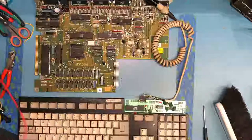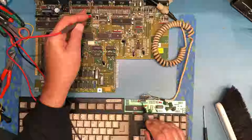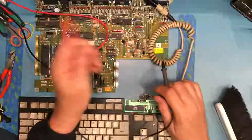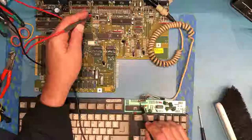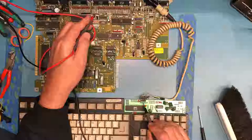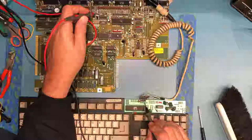But what I am going to do here is basically buzz with everything plugged in. I'm going to buzz the pins out here and see if there's a one-to-one continuity. And so far there is. That would be reset, which doesn't seem to get passed through. Okay, so it's not one-to-one up to pin 3. So pin 1, or what I'm calling pin 1. Yeah, that's pin 1, pin 2. I didn't actually hook 3 up on the back of the, I think, 4. I can't see here. There are 1, 2, 3, 4, 5, doesn't seem to come through, and 6.